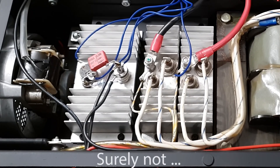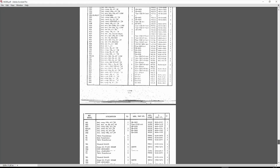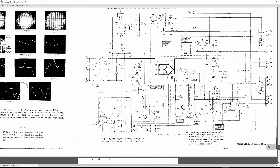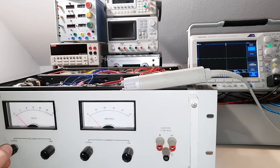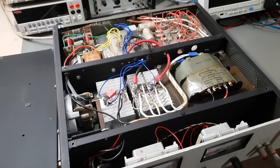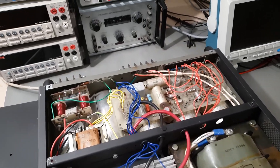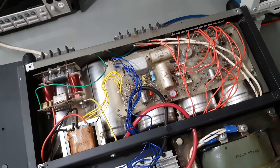Where are the cooling facilities which are supposed to make that possible? Well, that's what makes it interesting — there are no power transistors in here. The regulation is happening on the primary side of the mains transformer, and these thyristors are responsible. That's a very energy efficient and easy to build approach, but they had to equip all of these big expensive components in order to get competitive specs. It must be less than ideal by today's standards because power supplies are built differently now.